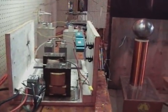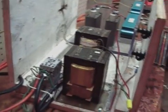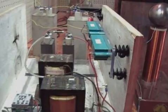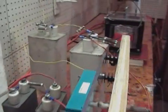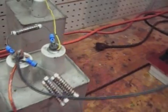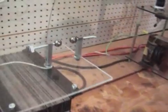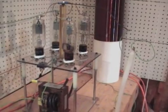Now you'll get to see what all this stuff looks like. To start out we have a 240 volt outlet, and our power goes through a contactor. This thing gets switched on and off remotely — I'm on the other side of the room when I run it. We have two microwave oven transformers, diodes for the voltage doubler circuit, capacitors, and bleeder resistors across the capacitors to drain the charge off. There's a charging choke with a safety gap.